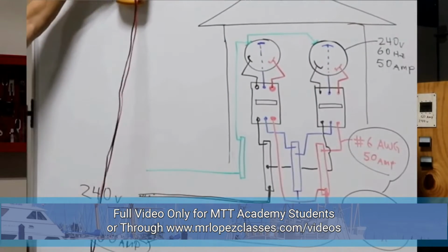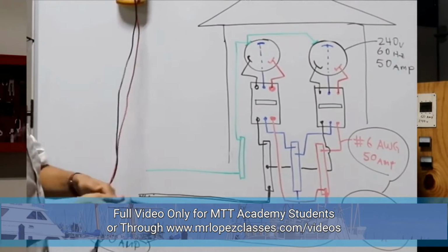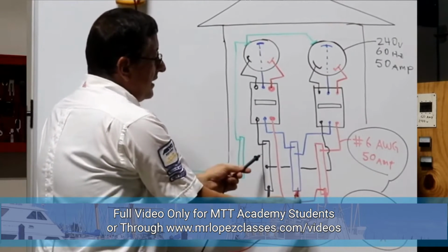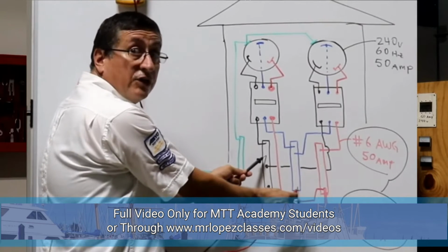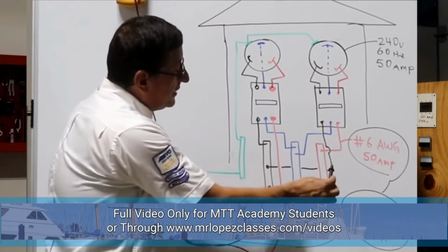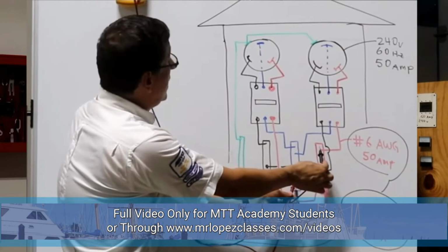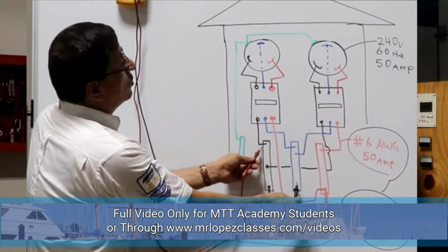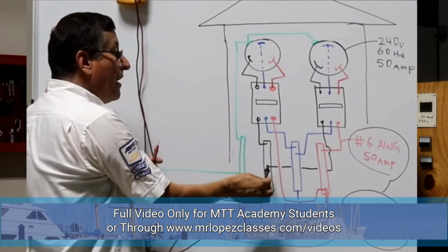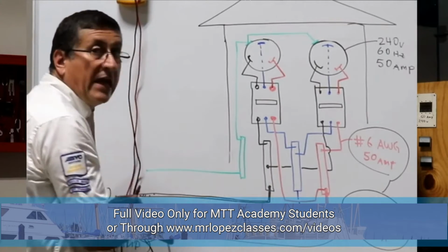With the voltmeter in volts AC, you select volts AC, the first function, and you check the voltage between the neutral bus bar and this bus bar. The voltage should be 120 volts. Okay, let me check. 120 and 0. I don't have power in this phase. I don't have power coming from the transformer in this bus bar, in the hot line number 1.